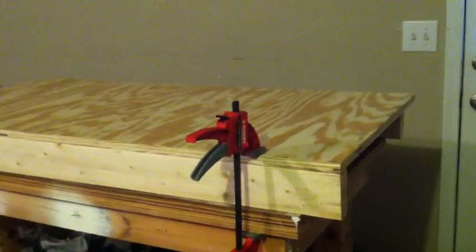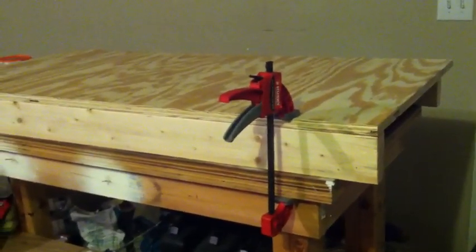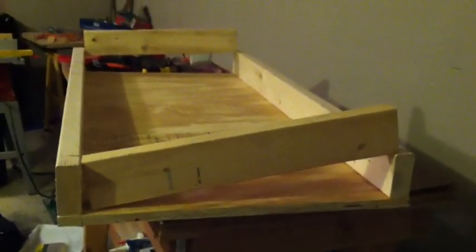The first thing I do when I put the boards on the frame is clamp the 48-inch two by four to the table and then drill some holes — I'll do four down the side. A little tip: I don't have a countersink bit, so I'll use a regular bit spun backwards so it doesn't take too much wood off. That way when I put my screw in I can countersink it and fill it with wood putty.